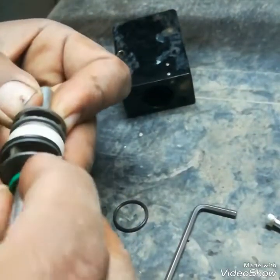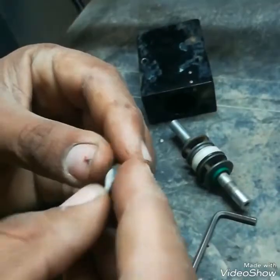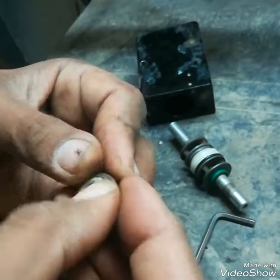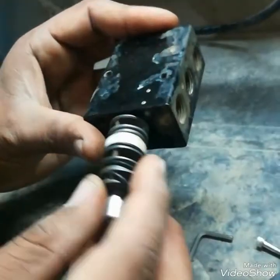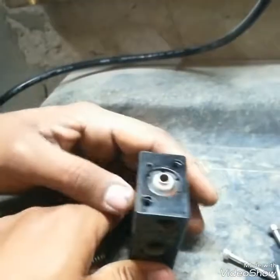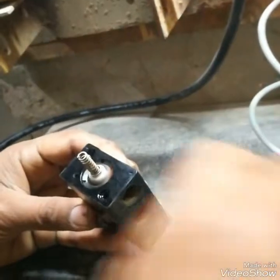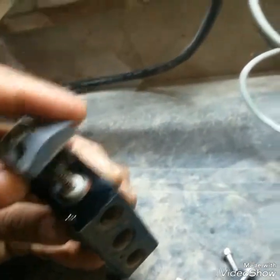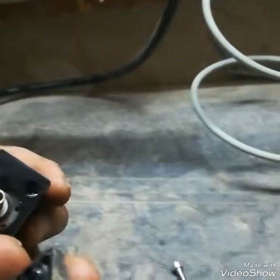The piston is moved by the coil. The SOV may be operated on 24 volts or 220 volts — it depends on the coil. If you use a 24-volt coil, it will operate on 24 volts; if the coil is 220 volts, the SOV will operate on 220 volts. It is just a matter of coil voltage and coil rating. I am now fixing it back.